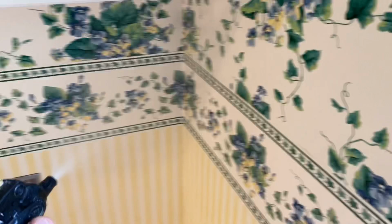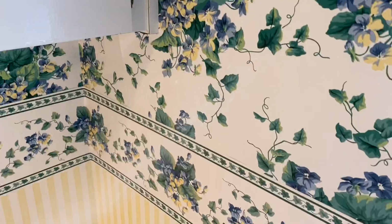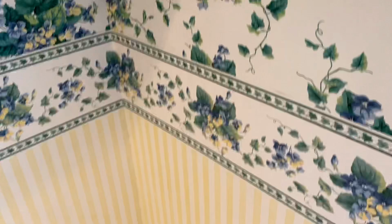I have seen roof leaks where the paint is actually holding back the water in a big blister, literally 2 feet long. Well, if there's wallpaper on that, the first thing that's coming down is the wallpaper, because the water liquefies the glue and compromises the integrity of the adhesion. It's really that simple.